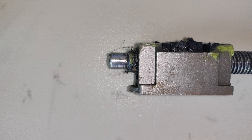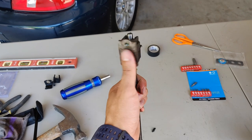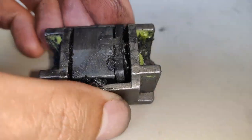Now you're halfway done. You can take a break, say hello to mom, and continue. Now this is an up close picture of the carriage connected to the rod. One important thing to note is that this will have to be in the same exact place when you reinstall it. I suggest taking a picture of it so you know exactly what it looks like prior to reinstallation. Twist off the carriage from the rod and you can begin removing the bushings.